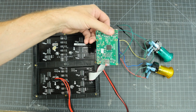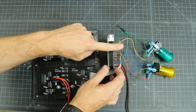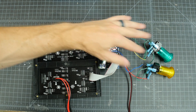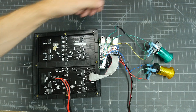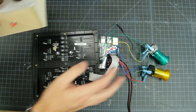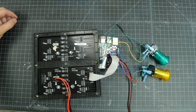I'm using a Raspberry Pi 3, but you could use any of them and it would work just fine. An extra thing I got were some extended headers that go up through the Pi hat rather than being short. This gives you a place to plug in some jumper wires. These jumper wires are running to the buttons both through the LED and for the button itself. I've only got two buttons set up here for testing and this wiring is all temporary. I'll add two more of these arcade buttons and then also hook up this power switch. That's really all the hardware you need for this project. I've got a 5-volt, 4-amp power supply — it needs to have enough amperage to run all of those LEDs.